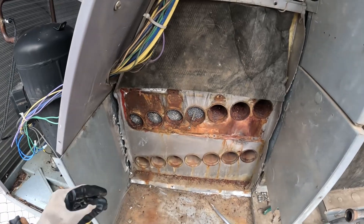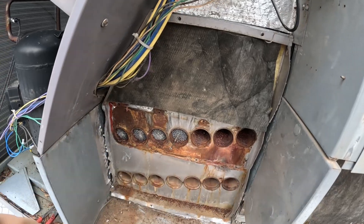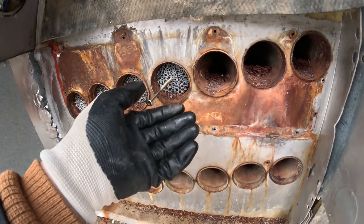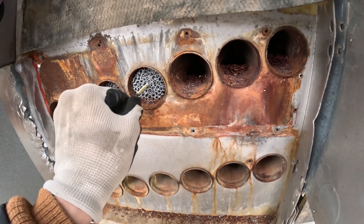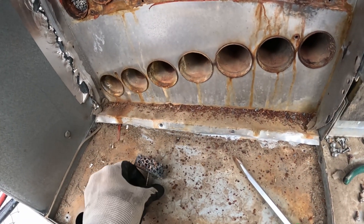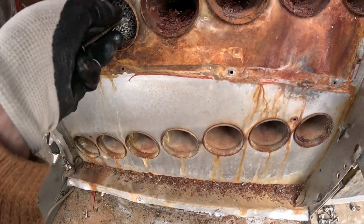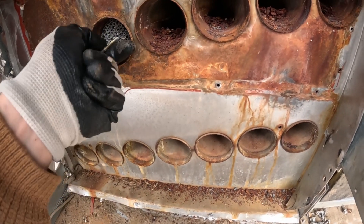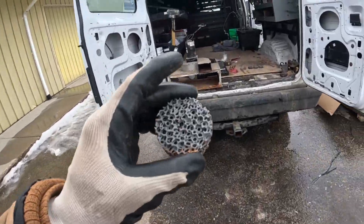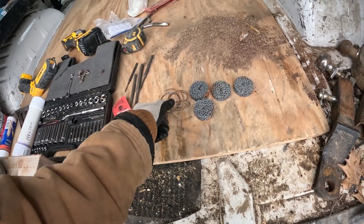The heat exchanger has these inserts on the collector box side. We did end up having to take that cover off — the screw heads were located on this side and were pretty rusty, but we got them off. These inserts have to come out and get put into the new one because they didn't send any with the new one. To get them out, you remove the metal clip and then thread a screw in and wiggle them out very carefully — they're made out of a ceramic, like a spider-webbed ceramic. I don't even know how they could possibly manufacture something like that. Here are the retainer clips.